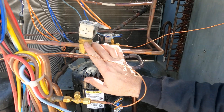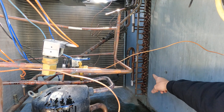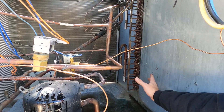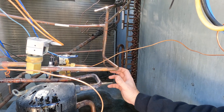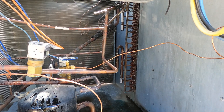If you look down in here, we actually have some hot gas valves, and that hot gas bypass is going to come over and dump into a separate hot gas reheat coil. So we're taking the heat out of the space as we are dehumidifying, but then we are putting the heat right back in the space so that we don't over cool.